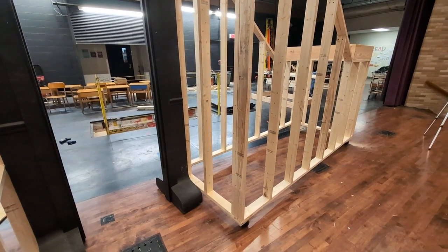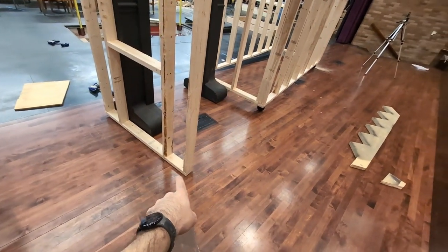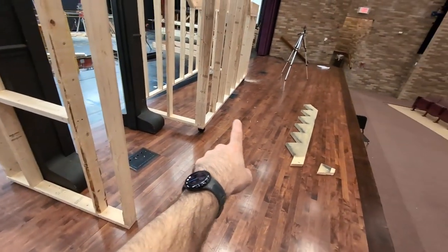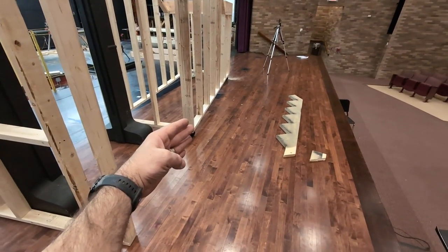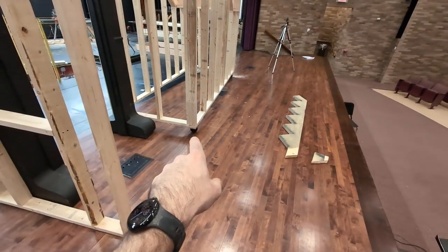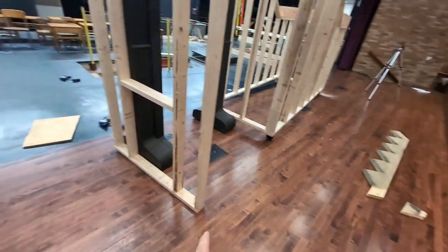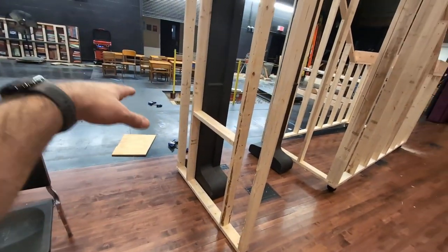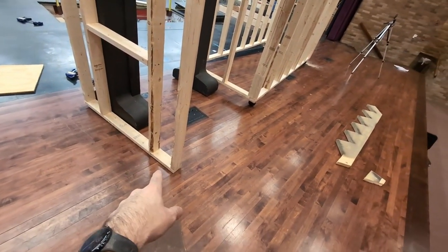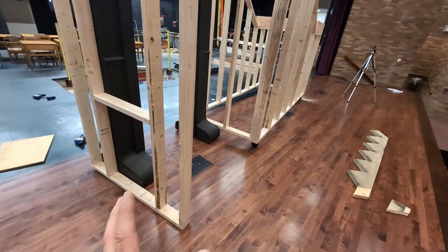I really still think, at the end of the day, since we have 1/2 inch clearance out here visually, like the rest of this is going to have Luan coming down to within 1/2 inch of the floor, but that's maintained by there being wheels. We're so far from wheels over here, being 1/2 inch off the floor physically and cruising around out here. This floor rolls up and down enough for us to find a few places where that scrubs the floor and gets hung up and ruins the momentum that stage crew has and otherwise causes problems.